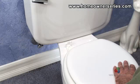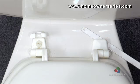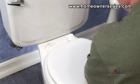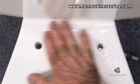Once the nut is removed on both sides, the toilet seat should be free. If a seat bolt has become corroded, then a mini hacksaw can be used to cut the bolt. Take the mini hacksaw and saw through the screw between the seat hinge and the porcelain bowl of the toilet. The mounting screws are often made of plastic, which greatly reduces the difficulty in this method.